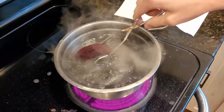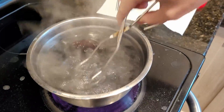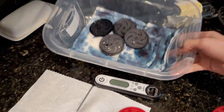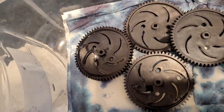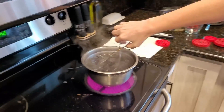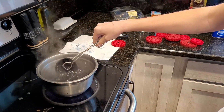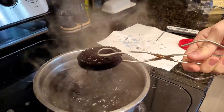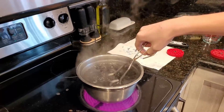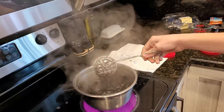After dyeing for a while we get this sort of blackish color. We've had to add in more dye and acetone a few times — once you've been dyeing for a while you'll want to add more in. The red gears take a little longer but the green ones have turned out looking blacker on camera, though they're actually kind of blue. We ended up deciding to go with a lot more black because the blue wasn't really dyeing. It's really easy to dye all parts black — you just add a lot of black dye and you don't even really need acetone for it.